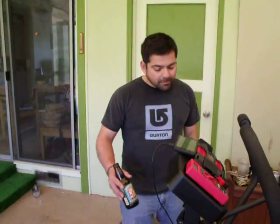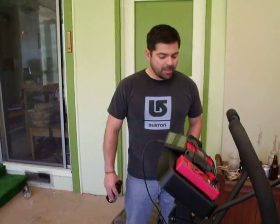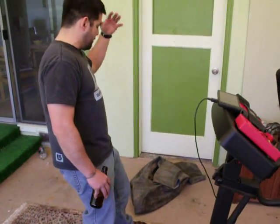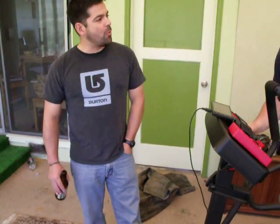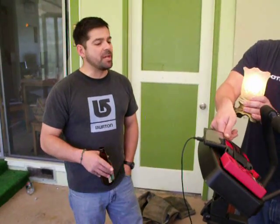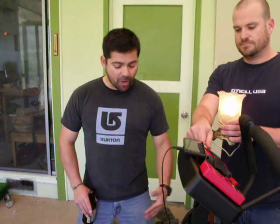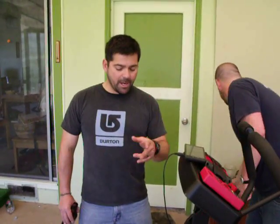As far as the rest, we wanted to make this out of the most recycled components as we possibly could. So, for example, if you need a new drive belt, we're giving you a whole bounty of rubber to use to make another one. The battery's the only thing that has about a one-year warranty on it, so if it craps out you can basically take it back to Interstate and get a new one. All the circuitry is pretty simple. The voltage regulator reduces or limits the amount of charge going into the battery, so it does protect that battery — it stays around 12 volts coming out into the battery.